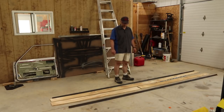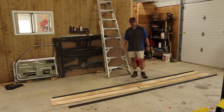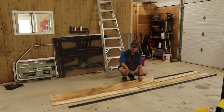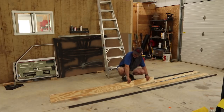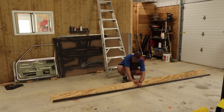I've got all the pieces cut out for my track. Normally you'd do this with a big I-beam, but I'm using stuff I have laying around. I don't plan on doing anything really heavy — 400 pounds max, which is what the hoist maxes out at anyway. I've got some plywood: two 8-foot sections and two 6-foot sections, making it about 14 feet long total. These are going to get sandwiched together to make the spine of the track.